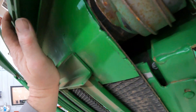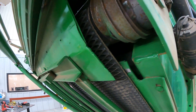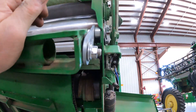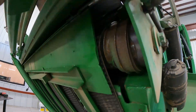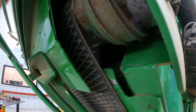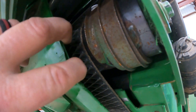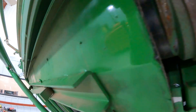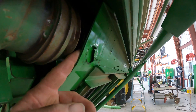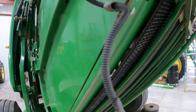We've got that adjusted where we have good contact in the right position of the pan. What we're after for tension is about five to ten pounds. This is sort of spring-loaded, so when we move the pan up or down we can adjust the pressure against the pan-to-belt contact. We want five to ten pounds, so that when we pull the pan down it takes five to ten pounds of pressure to release it off of the belt. That means when net comes in to feed into the baler, it gets pinched right between the pan and the belt to pull the net in.